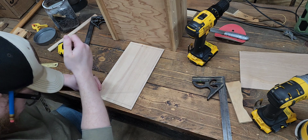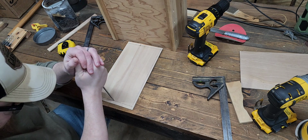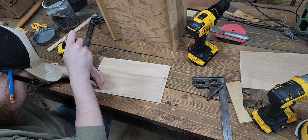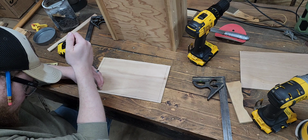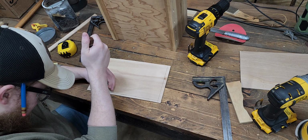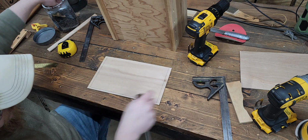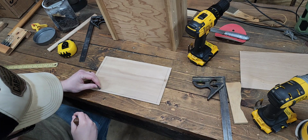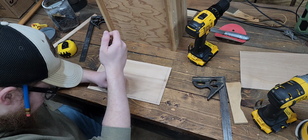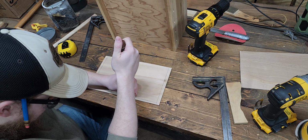These ones are fine to go right where we marked them. There you got our bottom ones. These ones are going to do just off center of that. The idea behind that is just to give that head of that screw 1/16 more before it's bumping that outside edge when we do the countersink. I know, it does not matter.